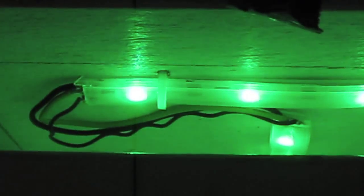It gets power and ground, and then one data connection right here on pin 6 of the Arduino. If we look in here, you can see a little more of the NeoPixel strips that are running each letter. This is actually the T, and for this one there are two strips — one going across for the cross part of the T, and one going down for the down stroke of the T. You can see the connections between strips there, and at the end of the strip there are three connections going to the next strip: power, ground, and data. I actually put a blob of hot glue there to provide some strain relief on the strip.